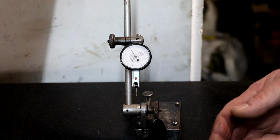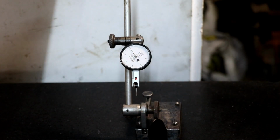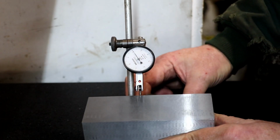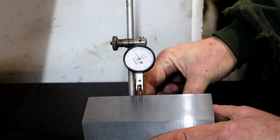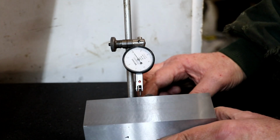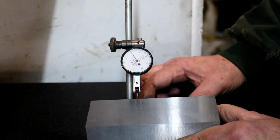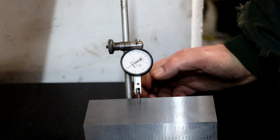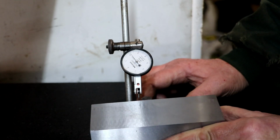So I've just been and ground these top and bottom. So we've got the 2 sides ground. Can we see that? Yeah. Got the 2 sides ground, which are nice and parallel to one another. And this is the side I've just ground. So we've got 0 there. And we've got less than 1 thou that side. Sorry, this is a 10th indicator, less than 1/10. So we're 1/10 under there. Yeah, the test indicator's getting blown out a bit. So we've got 0 there. We'll bring that in.